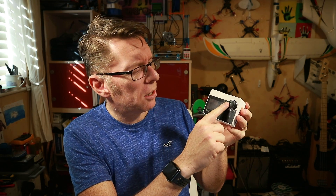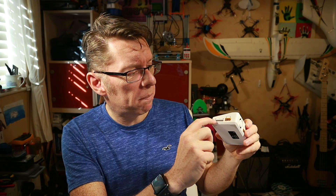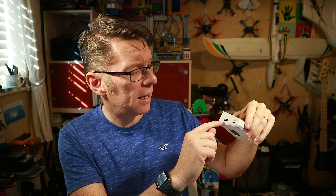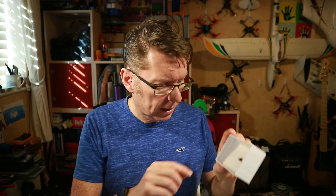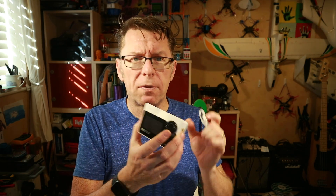Here's the device — this is the main thing. It's got a simple jog wheel and an exit button. Round the back: two fans, an input XT60, an output XT60, a big balance connector which can take 2S to 8S, a servo connector, and a USB. From the box we also get some brief instructions, though more in-depth instructions are available online, and a USB cable for updating the firmware, which we're going to do first.